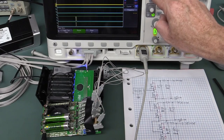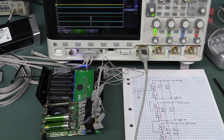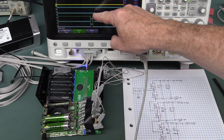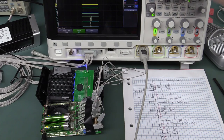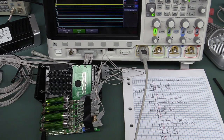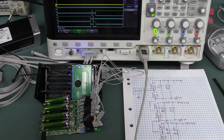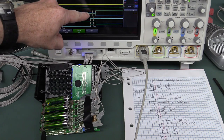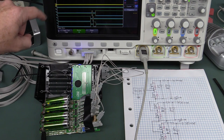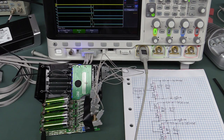Triggering off D0 and zooming out — that's interesting! I suspect if we put in the third and fourth batteries we'll see more activity. The time period is probably around a second — it might be switching off every second. I'm going to plug in all four batteries, switch it on, and see what happens. We've got something convoluted happening across three channels, but channel four might not be charging — just a dicky contact.